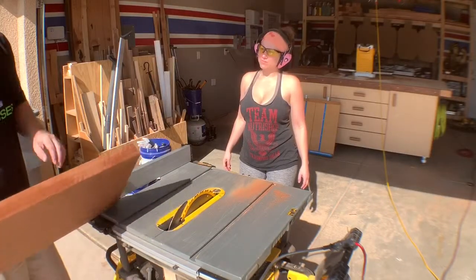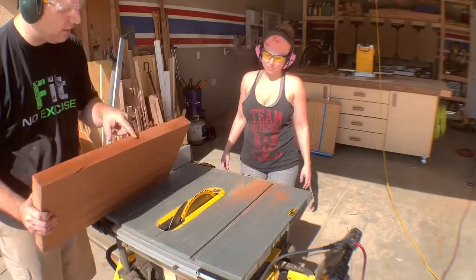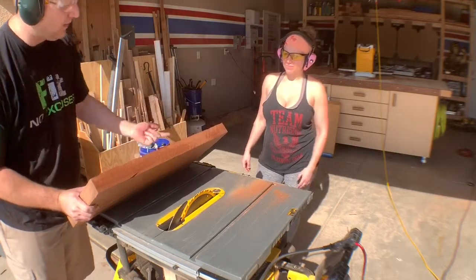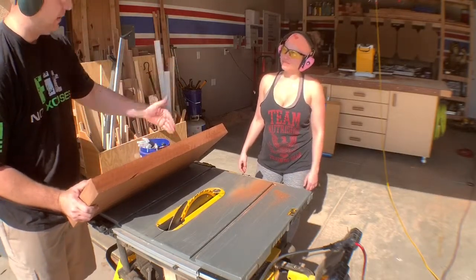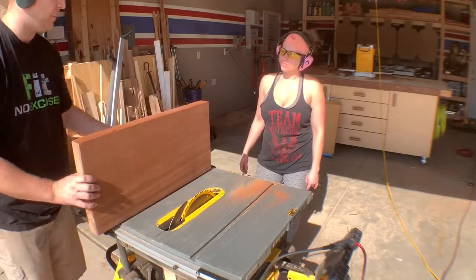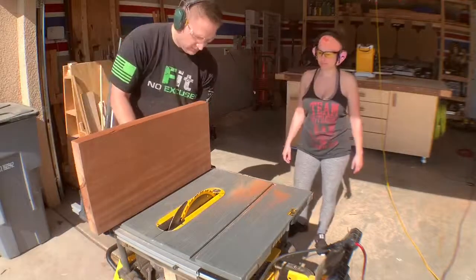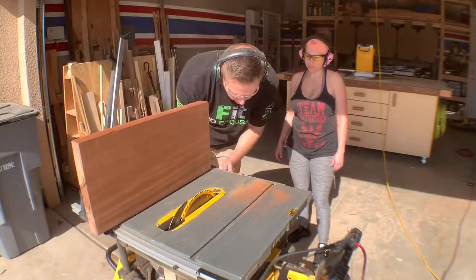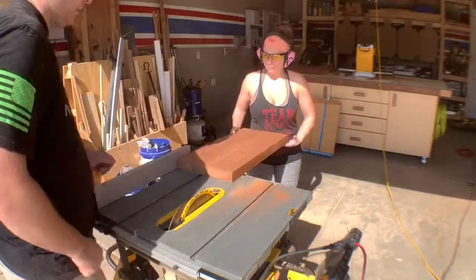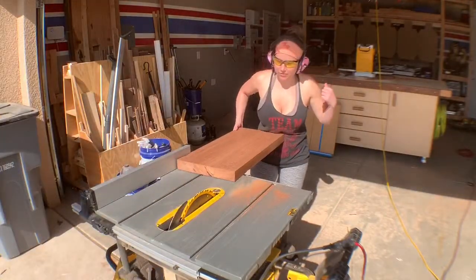Alright, so hopefully I picked that up on the camera. It actually started kicking out some sawdust because it was just barely skimming this last little part, which is why I always like to, when I turn it over, not move the fence. Because if there is anything out there, it just shaves it off and makes it nice and smooth. Okay. So all we're gonna do now, move in another 1/16 of an inch, which is just the width of the blade. Go again. Oh, Fred, dude.